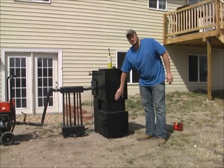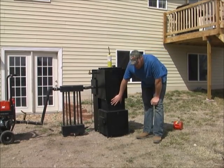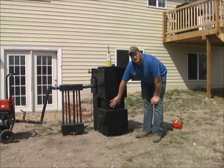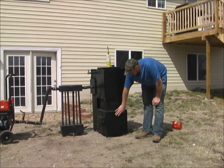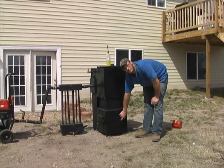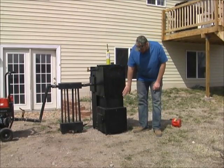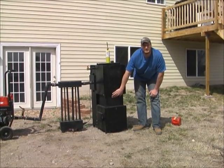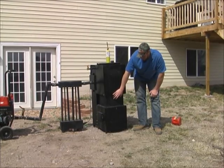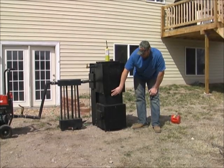The wood is stored up in here in this hopper area, and then it's thermally broken down in this center area — we'll just call this the reactor section. The ash and waste, the biochar, ends up in this lower part here. As it's thermally decomposed, oxygen is pulled into this combustion area, and during that process there are some very interesting things that happen.